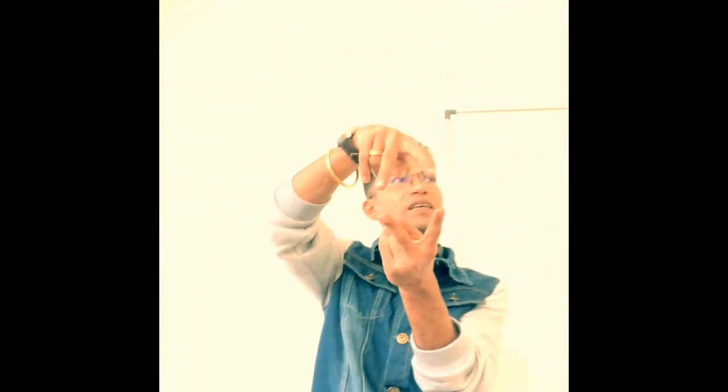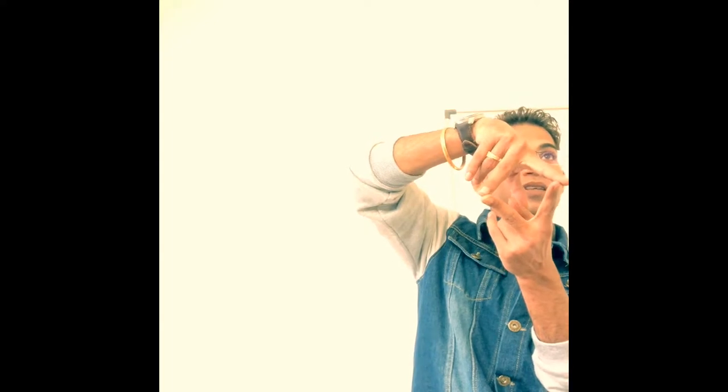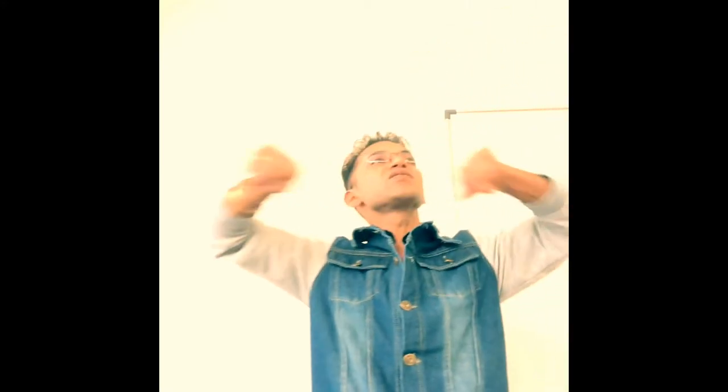Now whenever you are taking the measurement using the divider, there is a possibility that the divider might flatten out, isn't it? And if that happens, you won't get the correct marking on the other piece, and you won't be able to cut it properly. So that is why grooves are there, in order to ensure that you take the correct reading and the divider legs do not flatten out. Okay.